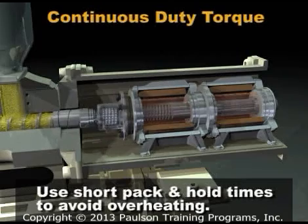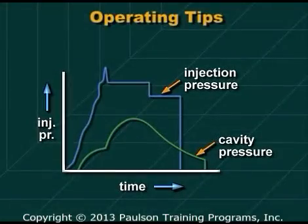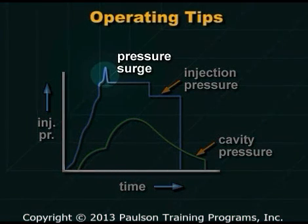Review the machine manufacturer's recommendations. Watch for pressure spikes from the ball screw load cell readout. Spikes in any of the readouts indicate pressure surges or electrical overloads on the servo motors.